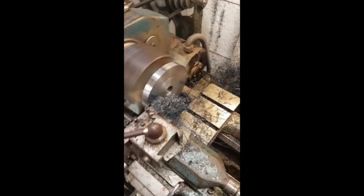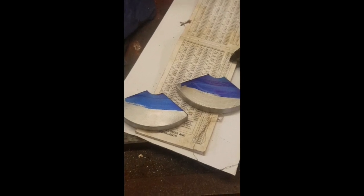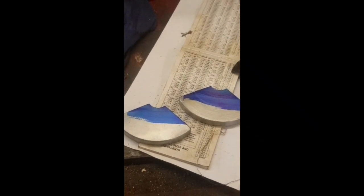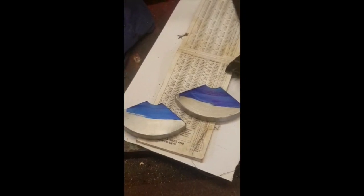As you can see it's a hell of a lot of material I need to remove, but at least I can give myself a new wig now. Here we have two of the crankshaft counterweights milled out to 110 degrees, milled out of those two discs.